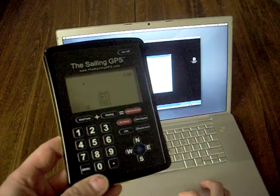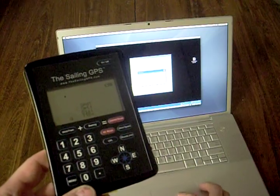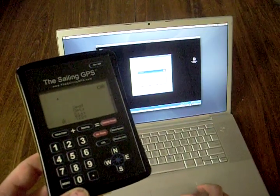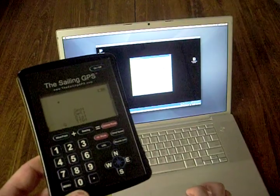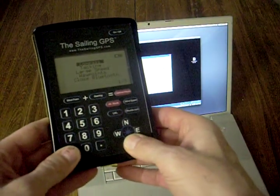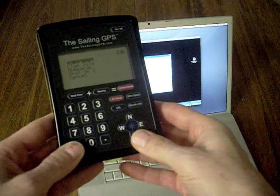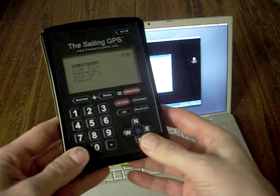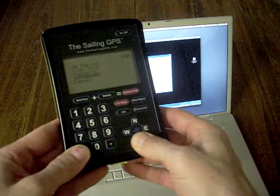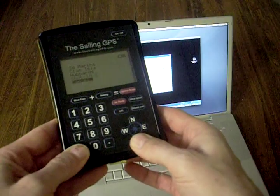It's kind of exciting to be able to transfer the latitude and longitude from an aerial photo through the air to the Sailing GPS. If Bluetooth was turned on on the Sailing GPS, we can then have a look and make sure that the waypoints showed up magically through the air using Bluetooth. We press the menu button, look at the first menu screen, go down to waypoints, and we see that the waypoint list has now shown up. We can choose any one of those to go to, and the Sailing GPS will know the exact direction and distance to each of them.